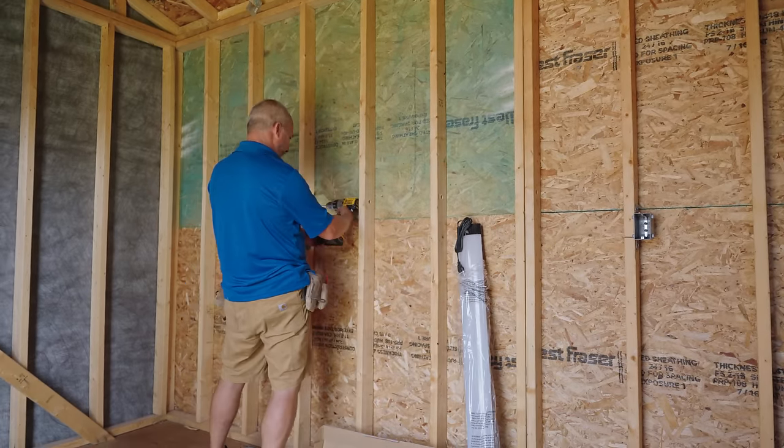Okay. And like I said, this is just so that you have a system. So if there's a failure along the way, you know the bottom is the power supply, the top is the feed. Okay. Same with the whites. All right. Now this is the bottom because we want to put the mouth of this plug down. Okay. Close it. Screw it. And this is the feed. And then this is your ground.